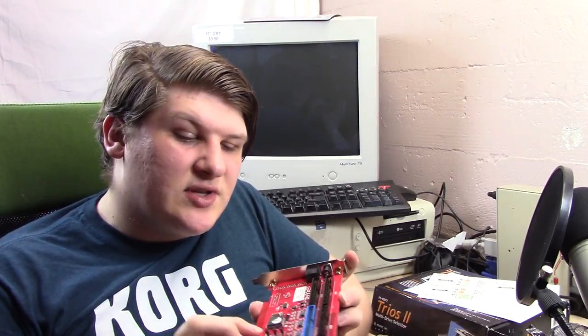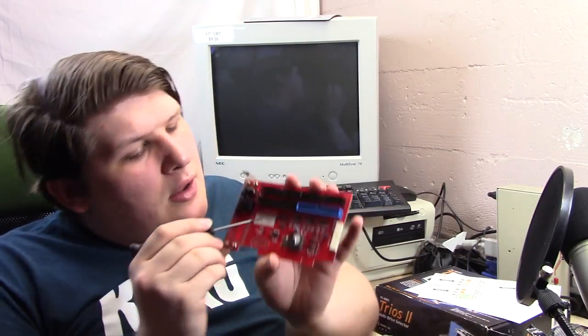And instead of using relays, they're just using these basic TO-92 power transistors. So either hard drive power consumption went down, or they realized that the relays were overkill, or transistors got better. The other components on here are actually a lot more interesting — they are 3861Q 10-bit bus switches. These little bitty ICs are banks of switches, so when you apply voltage to the input of one of them, it turns on or off 10 switches. Why that many? They must be doing something differently than they were with the other one — something significantly different. This board is unfortunately too complicated for me to figure out, but definitely a cool device. And hopefully it works because I actually do need to switch hard drives.